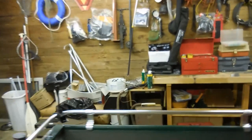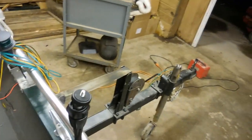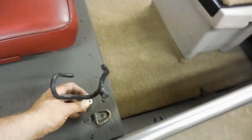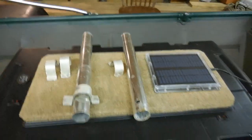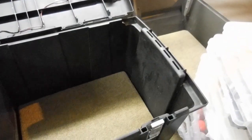With the remaining pieces of pipe I made two more rod holders for the sides, because I don't think I'm going to use these store-bought rod holders — there's nowhere to put them, you'd have to have brackets and there's nowhere to get them above this rail. So I'm going to make these rocket launchers. I made some brackets out of aluminum; they go over and pop rivet in. These are the bottom brackets — I can only do half — and the top ones go on next. I'll polish them up, so I'll have two rocket launchers there as well, giving me six total.